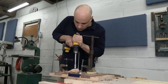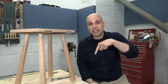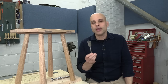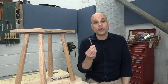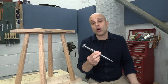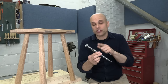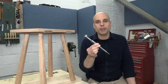The most important thing is to keep the bit spinning as you drill through the far side — that gives you a clean exit hole. When you're drilling leg holes for a chair, you really want a long drill bit because it's much easier to see what angle your drill is at. If you want to use a brace with a traditional auger bit, they're nice and long — that's perfect. If you'd rather use a power drill, spade bits can work, but they don't always leave a super clean hole. I really like Forstner bits in my cordless drill — they're clean and leave a nice sharp hole, but they're too short. So on a total whim, I went to Amazon and searched for 'Forstner bit extender' and found an eight-inch long adapter that just makes your Forstner bit longer. It fit this bit really well — a little too perfectly at first, but I rolled the shank on a fine diamond plate for a couple of minutes, and then it slid in so well that I'm just going to leave it permanently. This is just going to be my chair-making bit from here on.